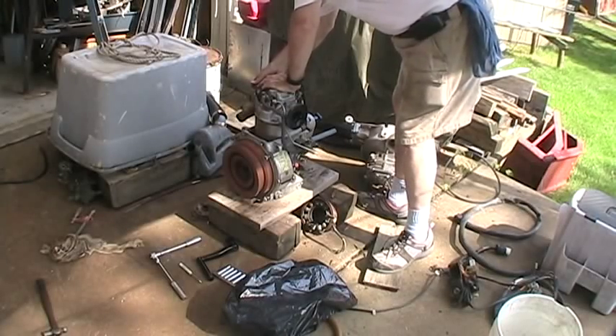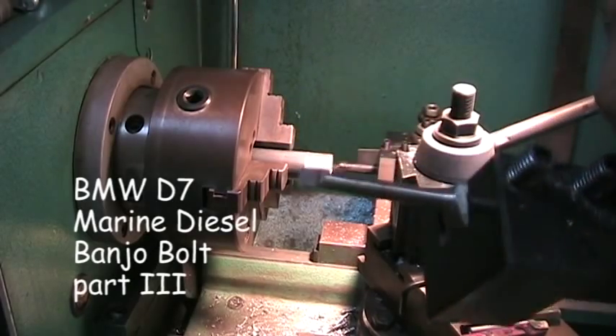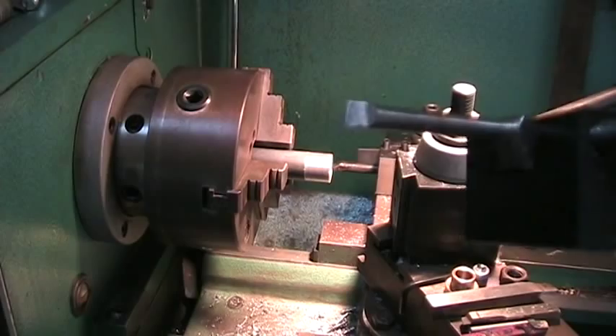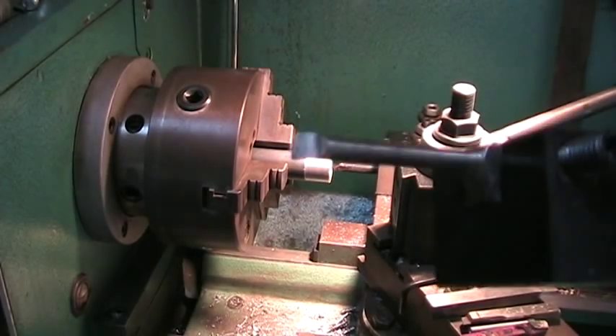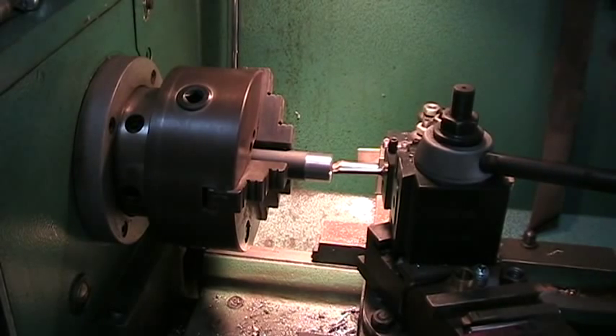I think I'll have it running in another week or so. Here's the tool I'm going to use for boring the drilled hole. You can see it's a ground 9/16ths high speed steel. Put that in, lock it down. I'm running 725 RPM.